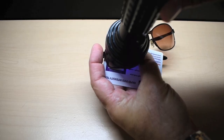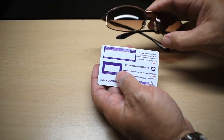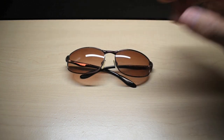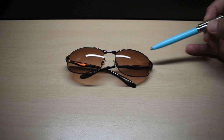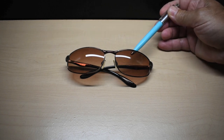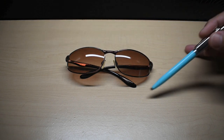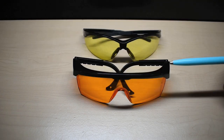Of course, you wouldn't have this flashlight — you'd be doing this outdoors. Take this away, and you can see nothing. Sometimes I've seen glasses where you're going to see just a pale color — that's an indication that the glasses are not blocking out 99.9%, maybe only 80%. And you also have to realize that when you're wearing glasses, even with them blocking out 99.9% of UVA and UVB, you're still going to have exposure to your eyes. The UV light is going to come in around the sides, reflect off the inside of the lens, and go into your eyes. That's why you want glasses that are almost 100% UV blocking, because UV light will always sneak in around the edges unless you're wearing very tight-fitting wraparound glasses or goggles.